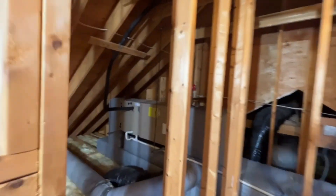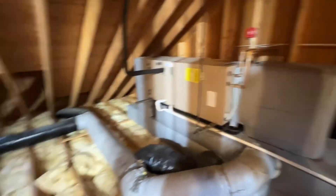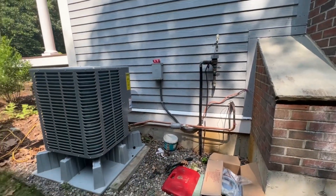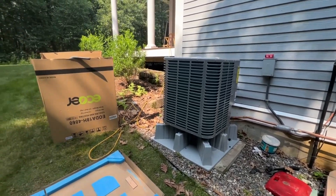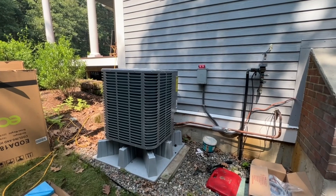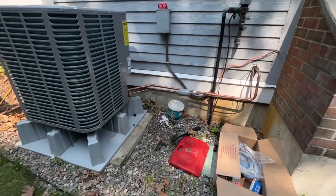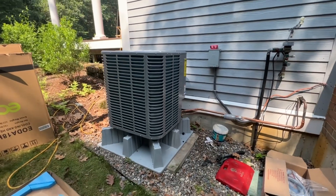Look at this — there'll be no crying tomorrow. Well, maybe a little bit when you try to get this thing out of here. But I rigged up a nice system for us. Yesterday, Michael was able to get the old failed R22 condensing unit out, and he set in place the new ECO high-output 4860 model R410A high-SEER heat pump unit. He's going to pressure test it today, then insulate, and then I'm going to get the attic air handler going.